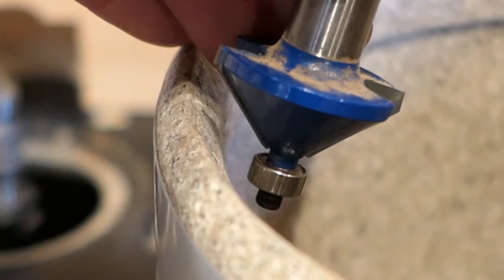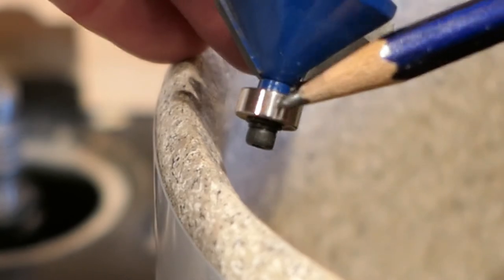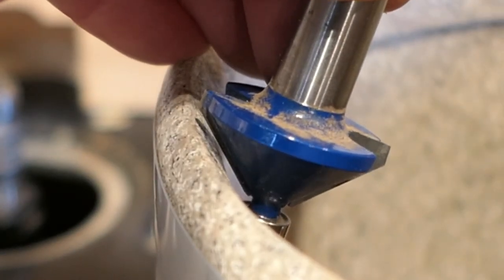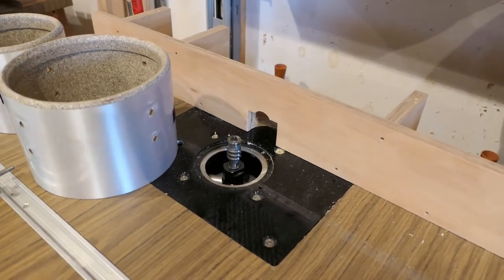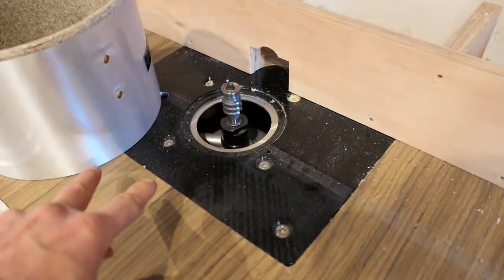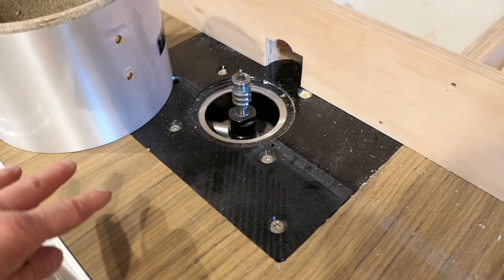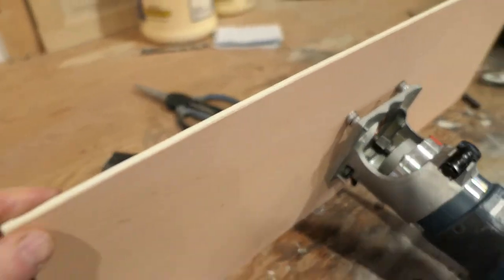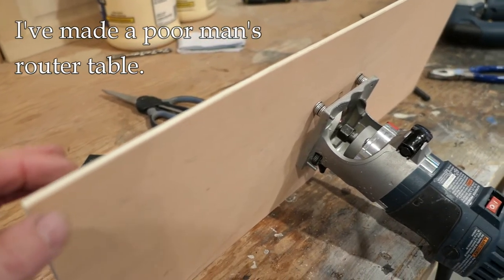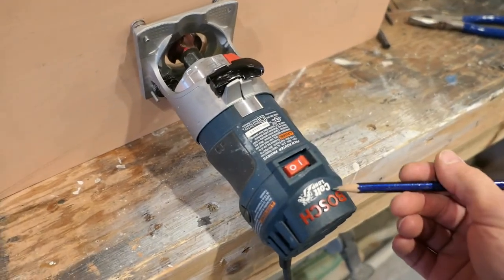What I'd like to do is get something closer to the original profile. One way to do that would be to tilt the bit — so now my 45 is at some different angle. I can still potentially use the ball bearing and ride that against the inside edge of the drum if I'm careful, but I have to tilt the bit, and in order to do that you've got to tilt the router. I do own two different router tables, but to tilt the router requires a special jig — it's just more than it's worth for me right now. So I have a different solution. I took a piece of plywood — it's pretty thin, only quarter inch; arguably I should be using three-eighths or half inch, but this is what I had as scrap. And I took a very small router — this is what I call a pony router, actually it's a Bosch router called a Colt. It's a good router.